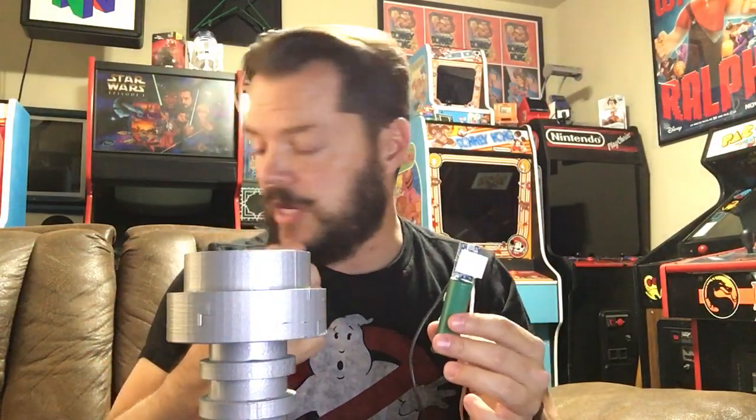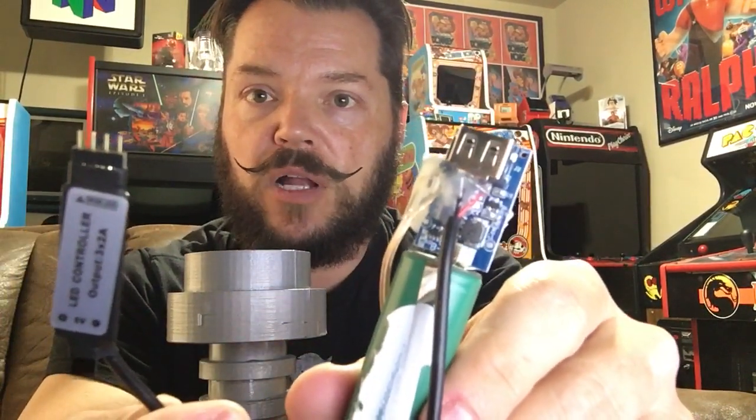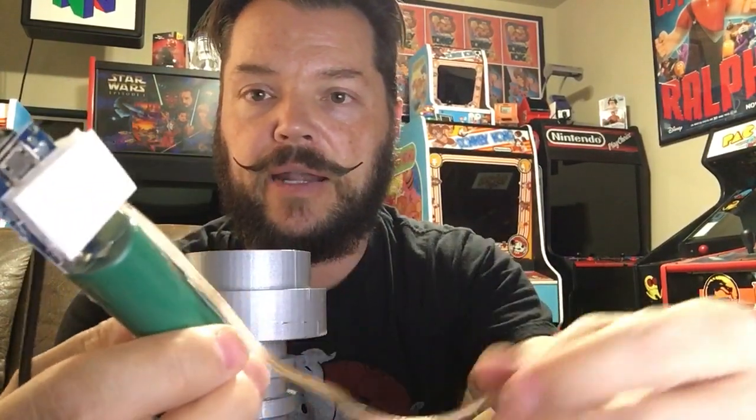In that same back-to-school area, they also had LED strips that go around the outside of your TV that are color-changing. I don't have the remote handy, but the neat thing is the controller for that LED strip is this big — pretty small — and that's the infrared sensor on the end for changing colors with the remote. So I just cut the USB portion off and wired it straight to the USB port, and then I added a push button.